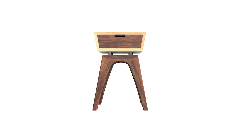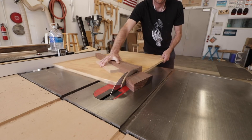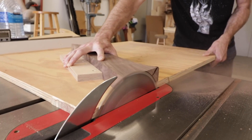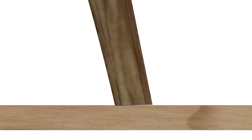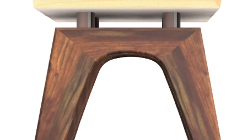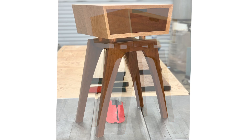To illustrate: say I want to make a little end table with simple splayed legs angled at 10 degrees. I set up my table saw sled and cut the angles on all parts, doing my best to hit the angle — but there's always some margin of error. Let's say I miss by a bit and the legs angle differently from the design. Not a big deal. And since each leg angle might not be perfectly accurate but they're all the same, as long as I trim all legs to the same length and parallel to the top, any discrepancy in the leg angle gets eliminated. Knowing when dimensions aren't absolutely critical is an important skill, and when I focus less on specific dimensions I can focus more on building a great-looking piece.